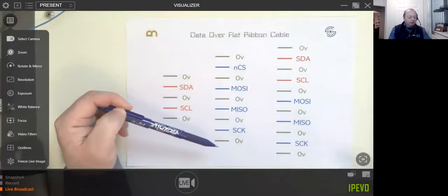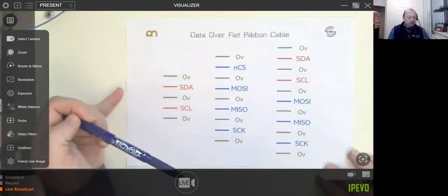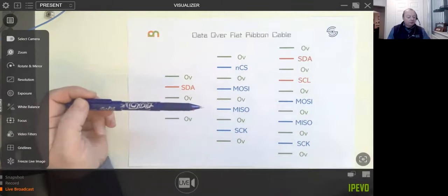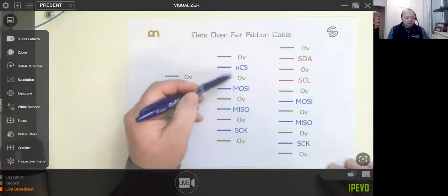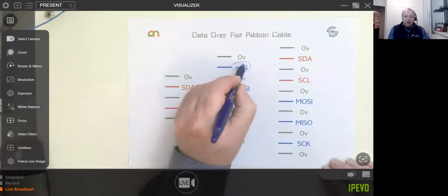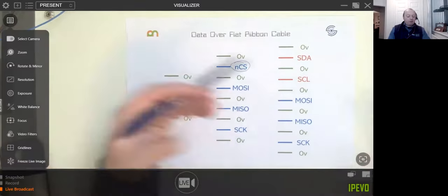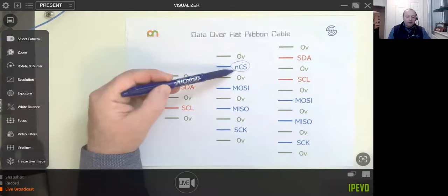Always interleave them. It'll give you much better radio immunity, which we mentioned earlier, EMC, and lower emissions, without a doubt. But of course, don't forget, if you're running just SPI over a cable, each device is going to have its own chip select line. So the more devices you want on the end of a ribbon cable, the wider that ribbon cable has got to be, because you've got to accommodate each device having its own chip select, let alone any interrupts, of course.